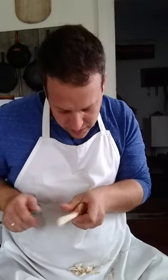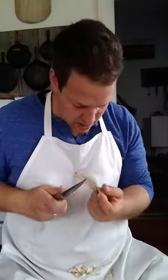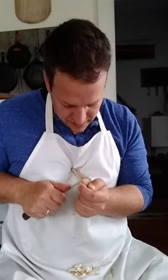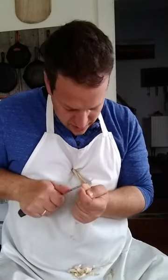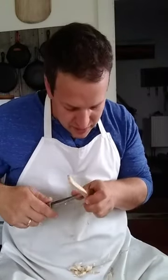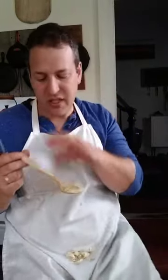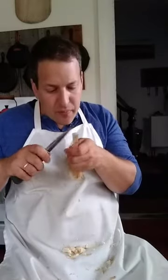This is also why I believe you should start off with a thicker neck than you think you're going to need, because you never quite know exactly where you want that material to be for it to be lined up with the bowl, etc. You want your neck to be thin, but you don't necessarily know right at the beginning exactly where. So leaving the neck of the spoon deliberately on the thick side is a smart move, because it allows you to adjust things to be exactly as you want them.